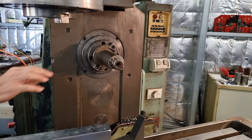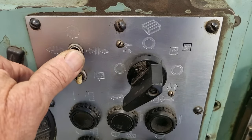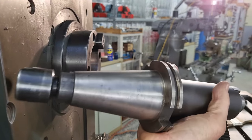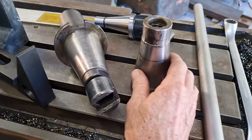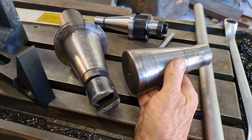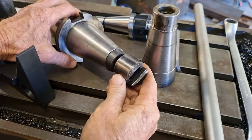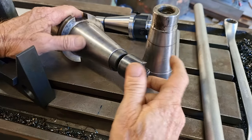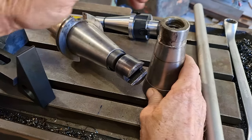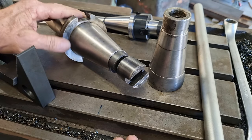Okay, now we need to eject this. So we have to put our dummy adapter in so we can still run the machine, because this will allow the interlock to be overridden and it will think there's a tool in place. Unfortunately, I have to make up some more of these bayonet style fittings for our NT series adapters. I've only got the one of them, so I'll just go and swap this one into here. It has a 20 millimeter thread. I think it's a 20 millimeter thread in these ones, and we'll get this one popped back in.